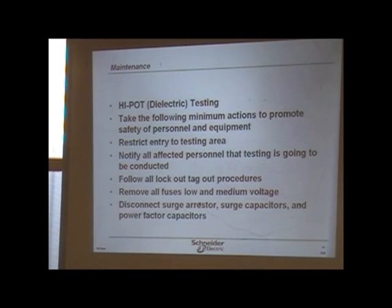So let's say this, and once again, if you haven't had NFPA 70E training, they actually show you how to do those calculations and so forth. That's why I can't get into that, because this is not an assembly class. But they'll show you how to do your own arc flash analysis, because you'll take the rating of the primary source that's feeding that breaker, then that breaker's rating, the seconds that it clears, and then the number of conductors.